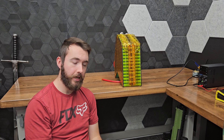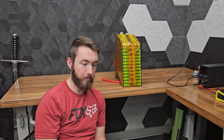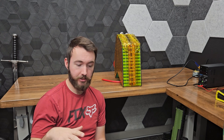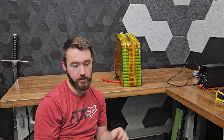When planning this battery, I wanted a good foldable connection, which has been done with nickel a lot of times, but I wanted to specifically avoid using nickel because it's a lot higher resistance than copper. Since I'm using copper for everything else on the battery, I wanted to stick to that low-resistance material. The way people do it with nickel is they just stick both halves of the battery next to each other and spot weld a single sheet across them, then fold that sheet over.